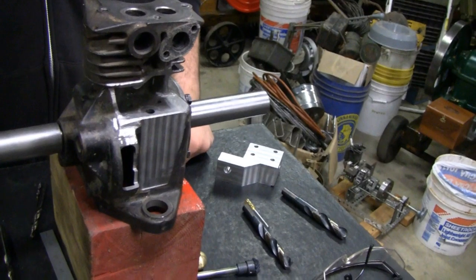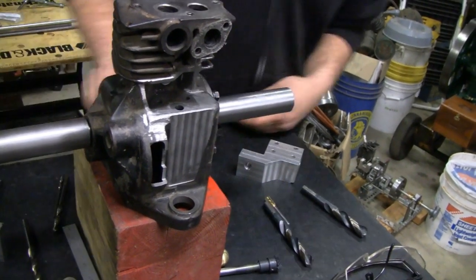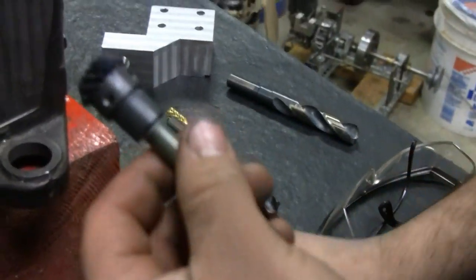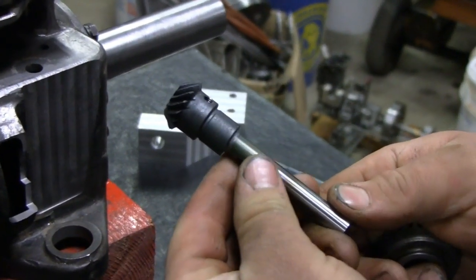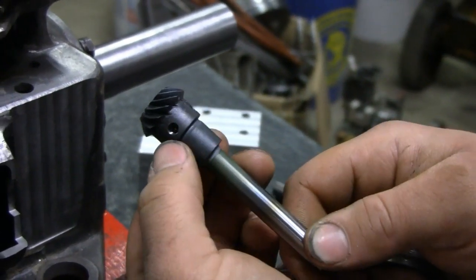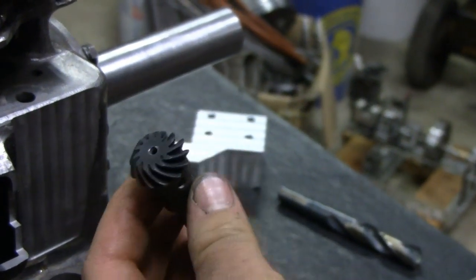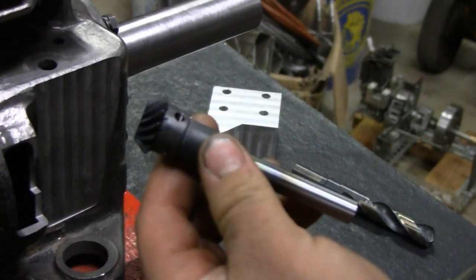Show them what you have to do with the gears — you got to drill through the gears. This pinion gear here was hardened and Mike had to anneal it — heat it up. Put some set screws in the side there; you can see where he drilled and tapped the holes. Now we're going to drill the center out to 3/8ths, and that'll be the shaft size.